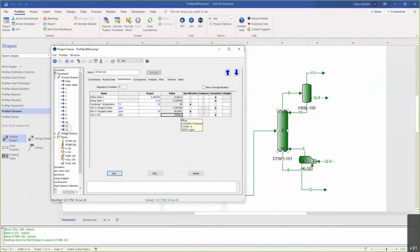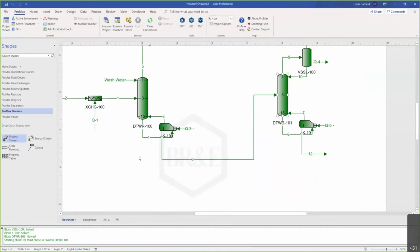So that's quite high. If you think about it, when Colin Nielsen was discussing the H2S content of the ammonia streams, they were suggesting that we should have, for anhydrous ammonia that's destined for incineration, about 1500 ppm. There's a lot of H2S in this ammonia. What we would need to do to remove it is to go through those wash stages, to go through those scrubbers. Let's table that discussion for the moment and finish building out this simulation, and then we'll circle back to that.